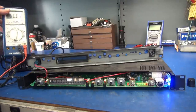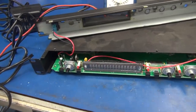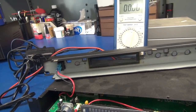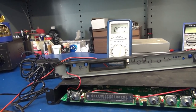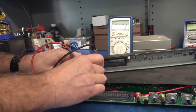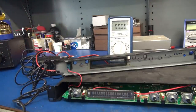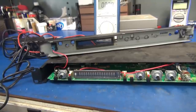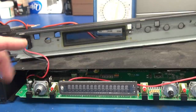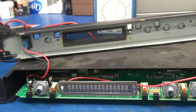That capacitor should have a measurable voltage. You're going to look behind the display unit — there is the capacitor — and you're going to measure across these two leads. Go across the cap and you should see 28 volts, and we do. Sometimes that capacitor will short and kill the display, but that is not the case here. We have a dead display. If you take a close look at the display tube you'll see a little white spot. This thing had been dropped, so obviously it lost vacuum somewhere. There's a hairline crack on the glass display.